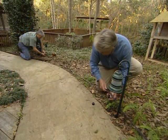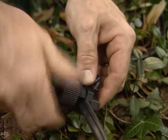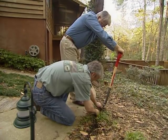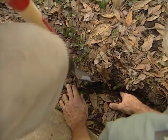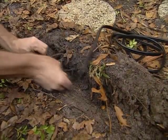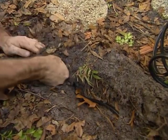The low-voltage power for these lights is carried by this weather-resistant cable made for underground use. Each light fixture attaches to the cable with a simple screw-on connector. Burying the cable is done most easily by using a flat garden spade. We push the spade into the ground at a 45-degree angle, then raise the spade handle until it's nearly vertical. This creates a V-shaped trench into which the cable can be placed.